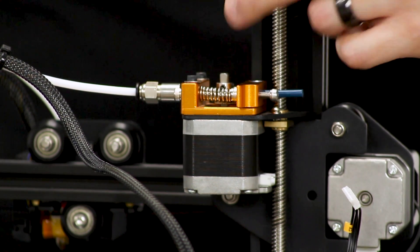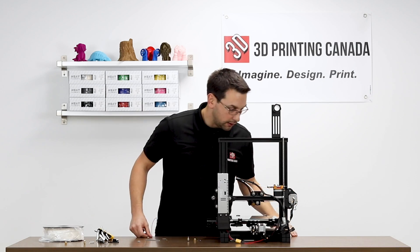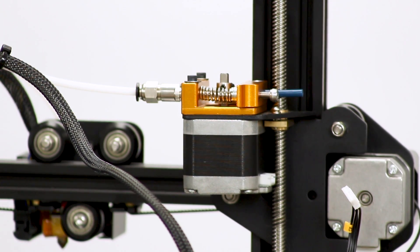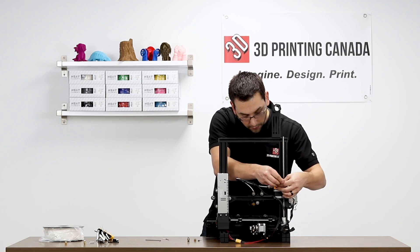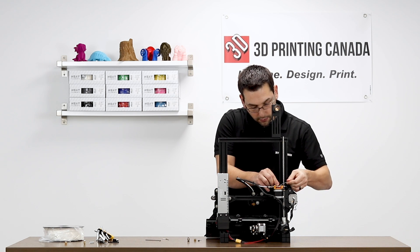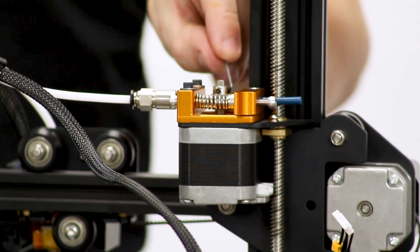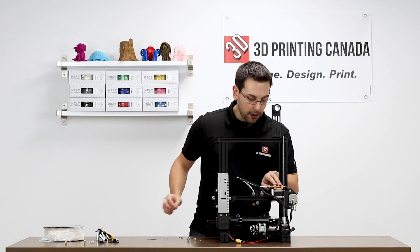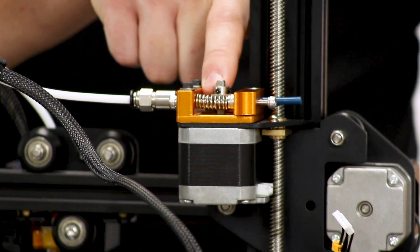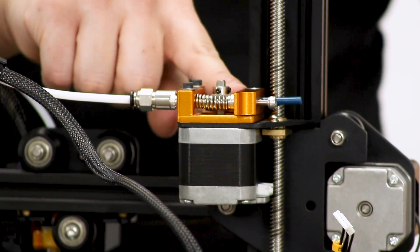As I mentioned, I wasn't exactly sure how high this gear needed to be. In my case it happened to be at basically the perfect height — I could move it up just a little bit. Luckily, because the set screws are exposed at the top, I'll be able to adjust those without disassembling anything. I'll loosen the two set screws and slide it upwards a little bit, so now the filament path is right in the center of the teeth, just to be safe.